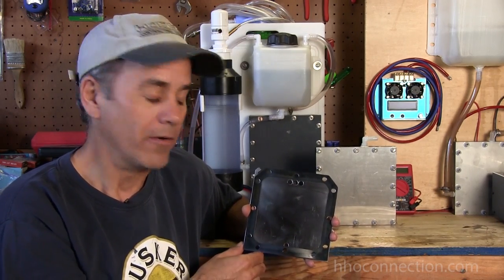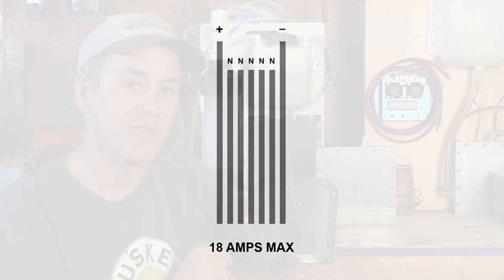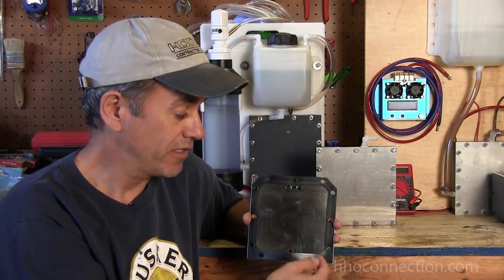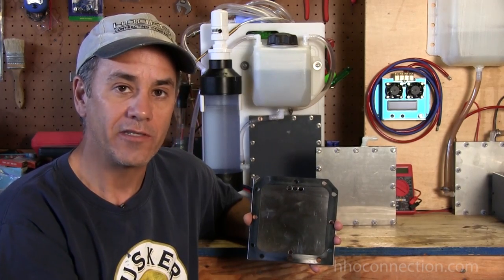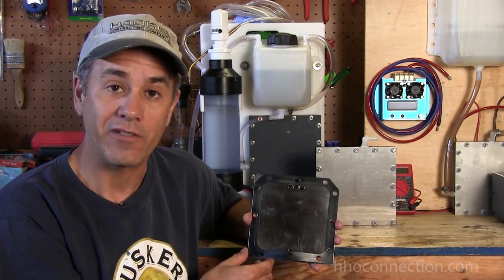That's your magic number — that's how many amps you can send to one series or one stack of plates. By that I mean one positive plate, one negative plate, and five neutral plates in between the two of them. So 18 amps is the maximum amount of amps you could send to a 7-plate cell that measures 7 by 7 with 6 by 6 inches of exposed surface area. If you want to get picky and account for the holes in the plates, you might knock it down to 16 or even 15 to play it safe.